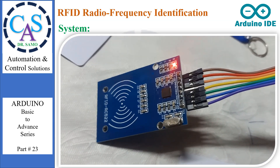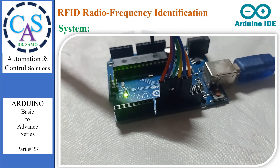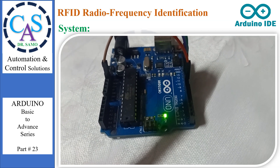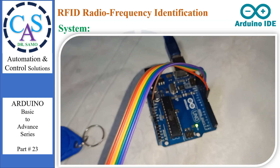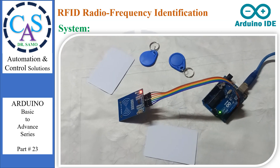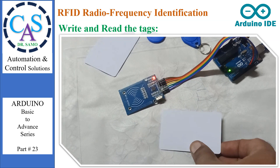We have followed the wiring as discussed before. The VCC pin is connected to the 3.3V Arduino pin. The reset pin is connected to Arduino pin number 9. The ground pin is connected to the Arduino ground pin. Don't connect the IRQ pin. Arduino pin numbers 9, 10, 11, 12, and 13 are used. Here we have 2 ID card tags and 2 keychain ID tags — the keychain tags can also be used as ID devices.